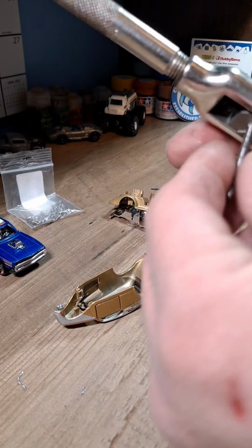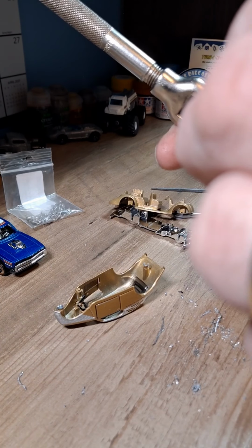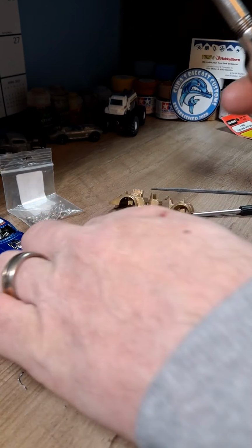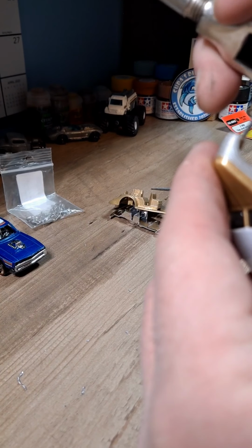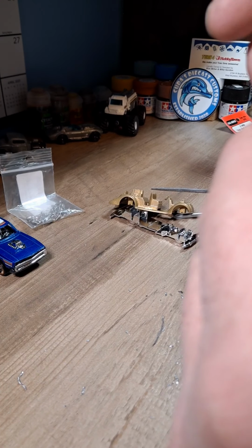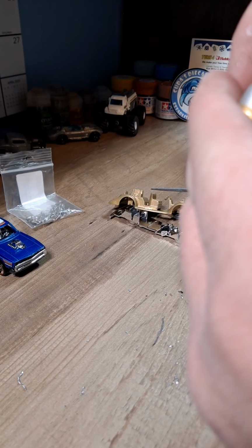So we're going to make sure the tap is clean, and give a little drop of oil on there. And we'll get in there and cut these threads. Again, my tool's huge. I've got to find me the right size handle to do this eventually.